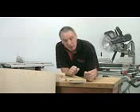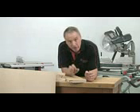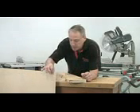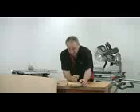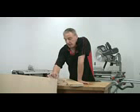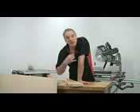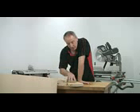This is the material I'm going to be using — some 1 inch maple, sometimes called rock maple. It's very light in colour but it is very, very hard. I'm also going to be using some maple veneered ply, this is 4mm. I use this for the back of the unit and also for the drawer bottom. You could just use thicker veneered ply or even veneered MDF and then lip the exposed edges to cover them up — it would probably be a lot quicker. But for me, you just cannot beat the feel and appearance of solid timber.